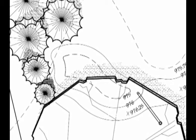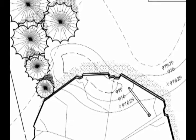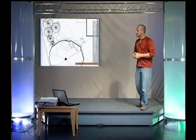The next line out is a solid line — that's the ponding depth. In this case it's about six inches. It typically never exceeds 12 inches. In clay soils it might be around four to six inches; in sandier soils, between six and 12 inches typically. Much deeper than that, you run the risk of extended ponding. We don't want to go more than about 24 to 48 hours.